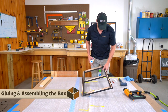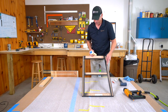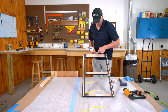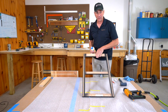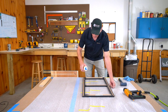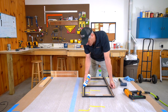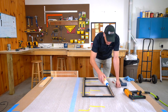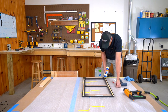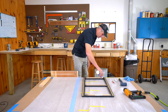We're going to glue the two shoulders — left and right of the deeper spline groove on both sides — where the cabinet top and bottom connect on the outside. We don't want to glue the little tab on the inside because the glue will squeeze out to the interior of the cabinet. Just run a thin bead down both shoulders and along the outside of the cabinet top and bottom.